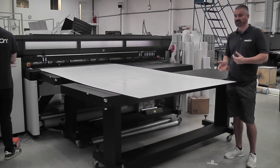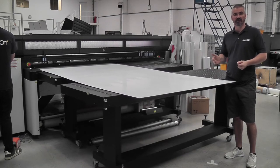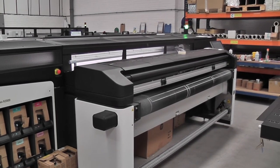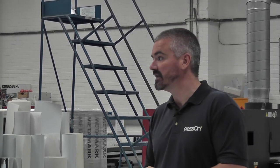As the new Latex technology is now gaining traction within the marketplace, more and more of our material suppliers are doing products specifically designed for the HP Latex flatbed machine. It's important to remember that although the HP Latex printers and many hybrid UV printers perform the same function, they use very different science. UV printers predominantly use UV light to cure the ink, whereas Latex printers use heat to cure the ink because they are water-based. This panel from Multi-Panel has a coating specifically designed to take the latex ink, making it very robust when adhering to this particular painted coating.